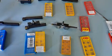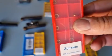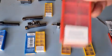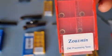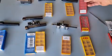The next one that leaves a beautiful finish are the button type ones — the little round circular ones. These come in all different sizes, and because of the large radius you can get a good surface finish and put a nice radius on a piece of metal. You can also use them multiple times because as they get blunt you can turn them around — you've got 360 degrees, so quite a lot of usable corners. They come in different relief angles and chip breaker shapes.